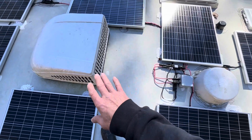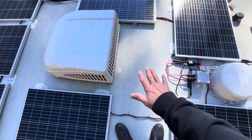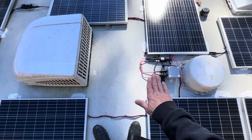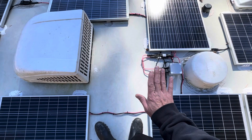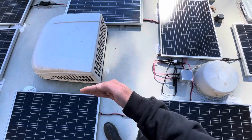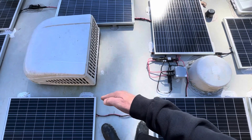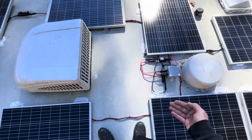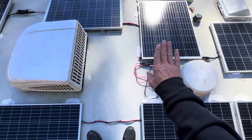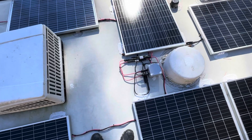I've got a lot of shading going on this midday — there's a big huge white pine that's shading me out right now. The panels are flat and the sun angle is low, so we're not making killer power right now. But in the summer when the sun's directly overhead moving this way — this is facing east to west — it's going to scream, the sun's going to hit it all day long. The forest is shading me out a little bit right now, which I knew going into this.